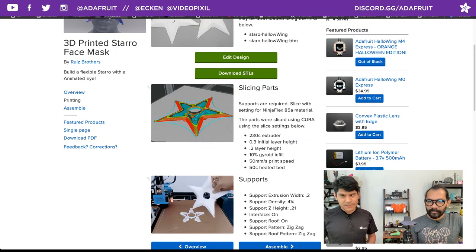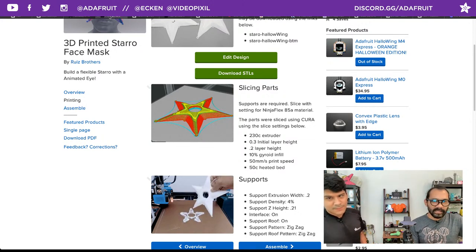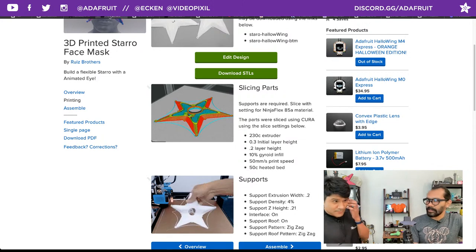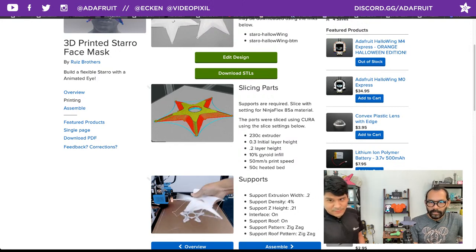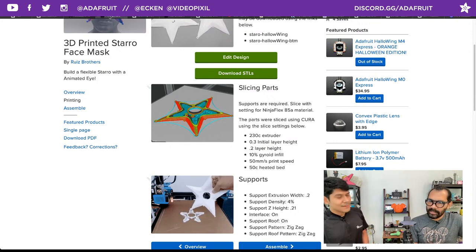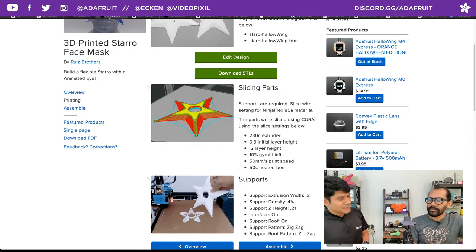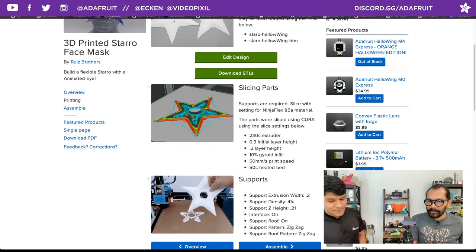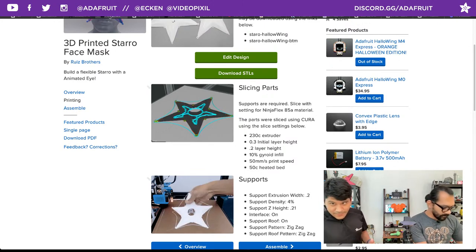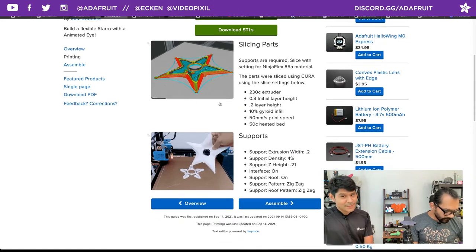Okay. Yeah. How about a heated bed? Heated bed, 50C? 50C is plenty. You can actually print, if you're using blue tape, you don't need any heat at all. Yeah, you can print cold. Which is amazing, but you've got to use that blue tape, right? Mm-hmm. Okay, cool. It might work with the PEI. I did not try it, but it might work. For the glass bed, you do have to use 50C for that heated bed. And so that's your baseline slice settings.